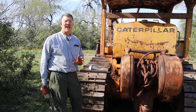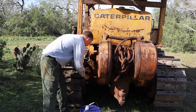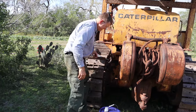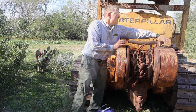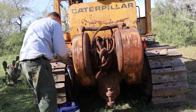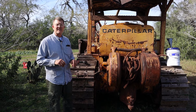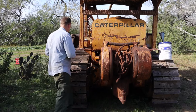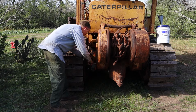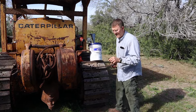Okay, now we're going to go ahead and check the final drives for oil. So we've got one here and one on the other side. It takes 90 weight. All right, no oil evident there. I've topped off the final drives. Both of them took about 2 gallons of 90 weight, so let's go ahead and get those buttoned back up. And yeah, if you notice, one of them's got a hex drive and one of them's got a square drive. Not sure why, but...